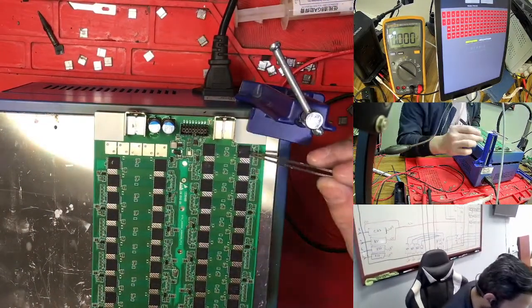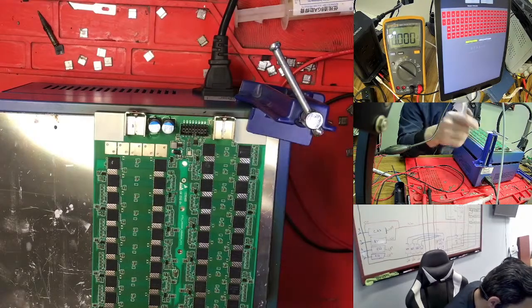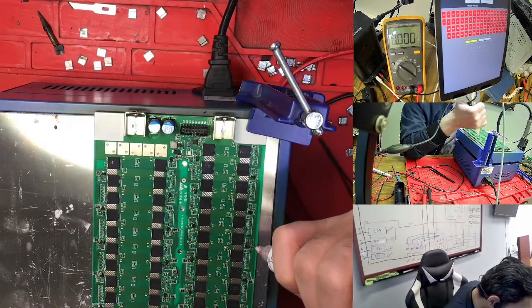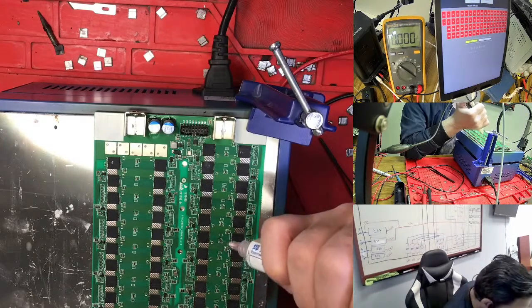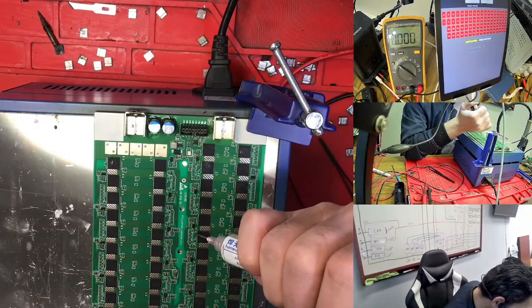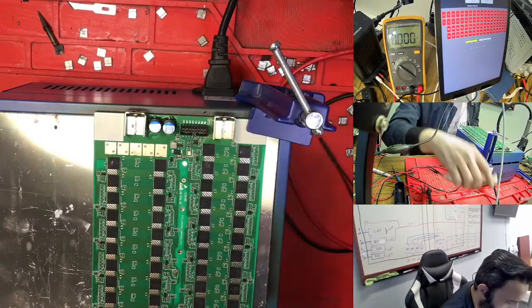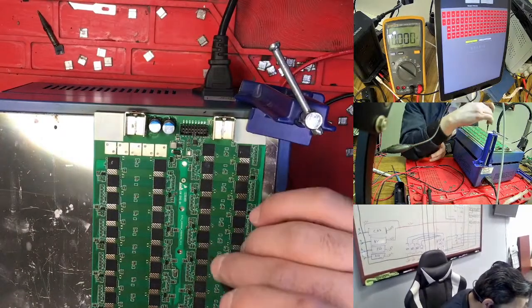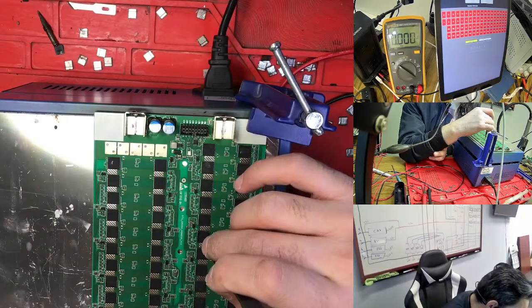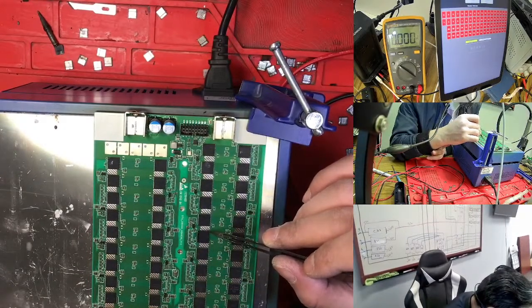12. So you see this is very hot right now, is very good. If you touch the chip right away, it is making a moving. 1, 2, 3, 4, 5, 6. So the 12 is this one, between 12 and 11. So just time reflow here and here. But don't shake your hand because otherwise the chip is moving. So just you slowly touch the chip to press down.